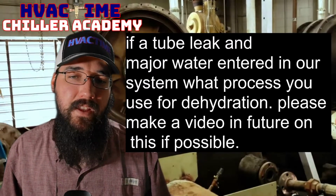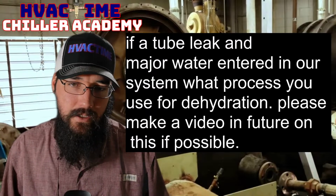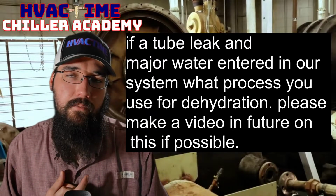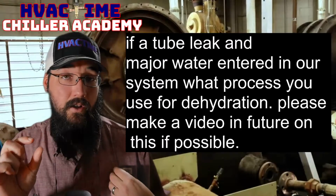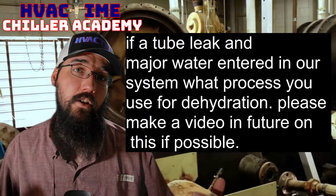So, anyway, to your point specifically, major leak, major water in the system. In my opinion, some people might tell you just plug the tube. I personally, if it's major, we're not talking just a minor leak. If it's a major leak, we just need to go ahead and look at a retube.